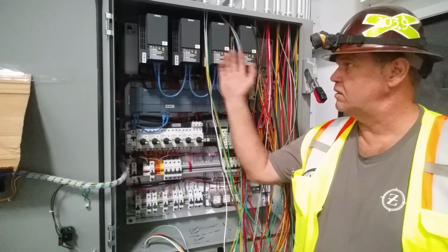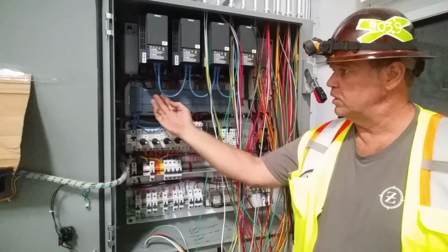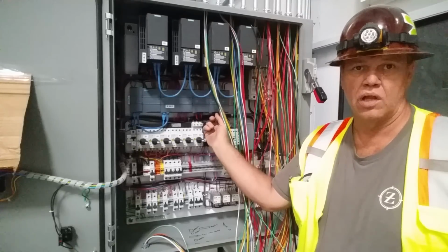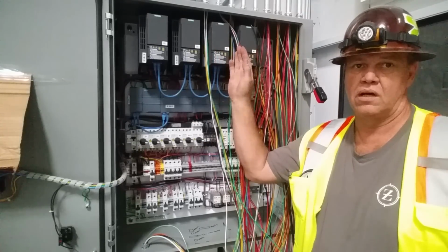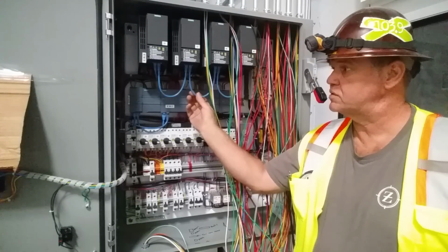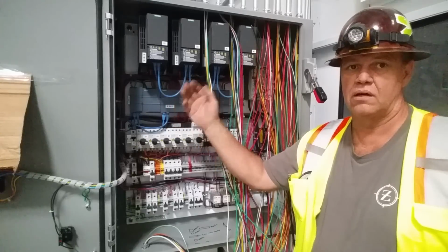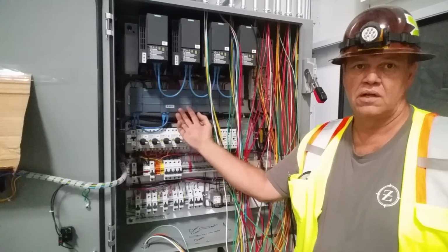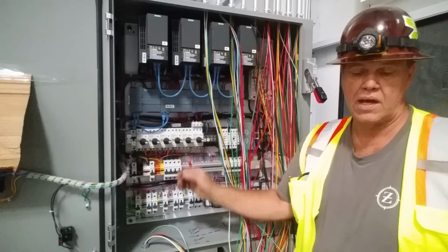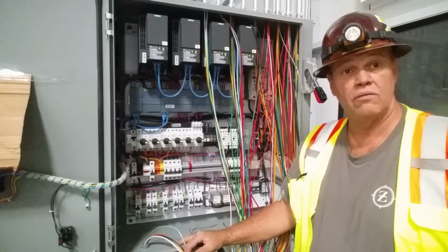This is a four bank of VFDs that are all on a network. Below it is a PLC, which is a programmable logic controller. So we've got Cat5 cable in here, which is shielded fairly nicely. It's a nice Cat5, but we still don't want to crowd it with any frequencies coming out of the drives. They could really induce some bad frequencies and induce voltage into some of the low volt stuff.